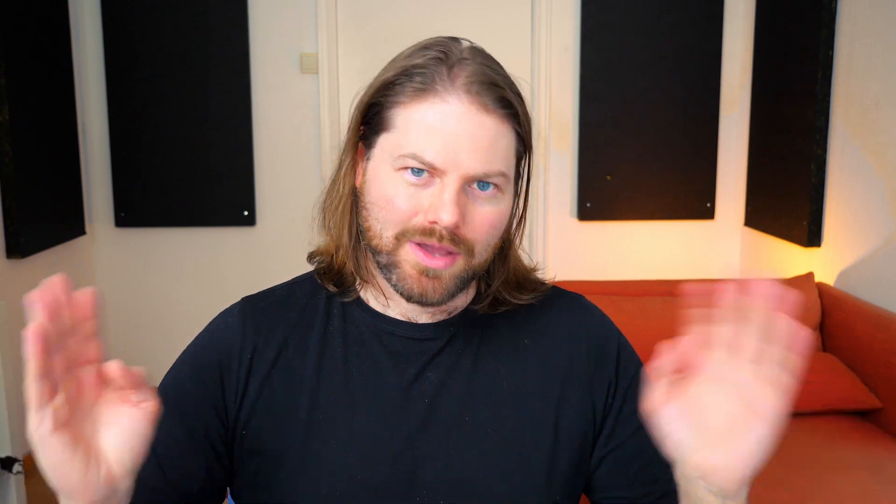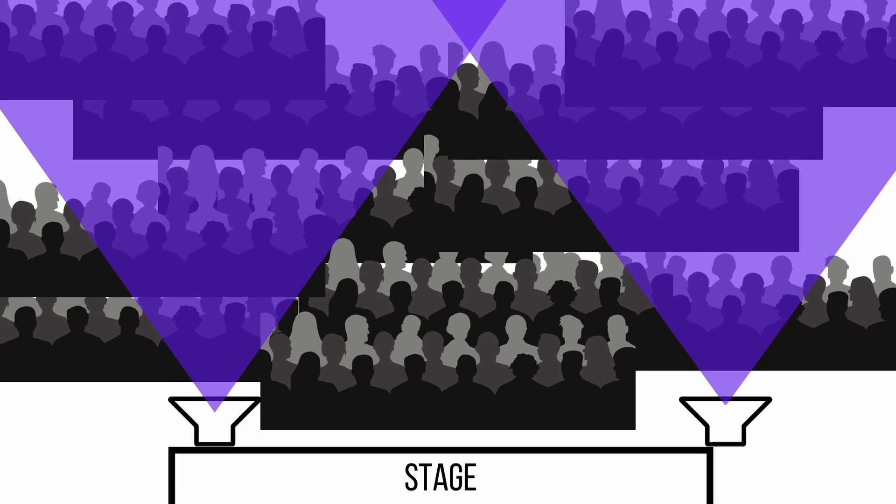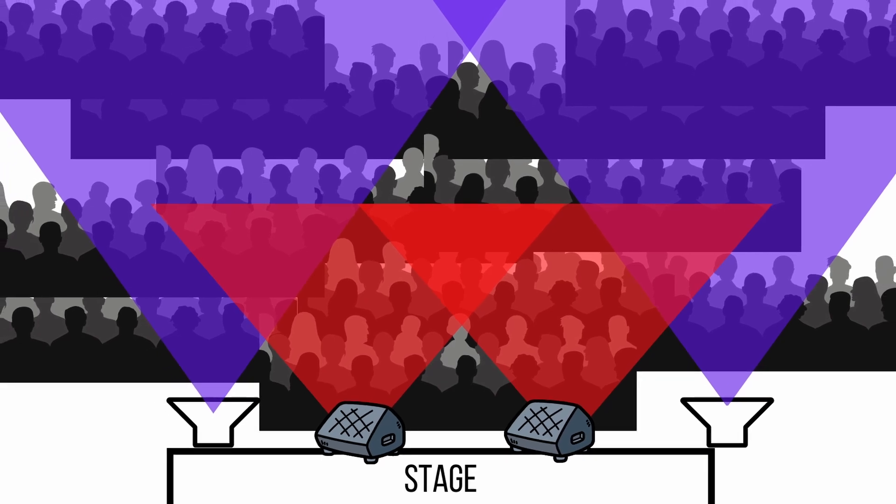If your stage is three or four meters wide and you have speakers at each side, you're quite likely to get good coverage of the whole audience if they're only five or ten meters back. As the stage gets wider, these two speakers are further from each other and that 90-degree angle doesn't overlap in the same way — it doesn't cover the same area. There ends up a hole in the center at the front of the stage. If people are standing there, they're not going to hear the vocals, and they're not going to hear the guitar as well — though in a small venue they're probably getting blasted by the guitar amplifier. But you have a coverage problem at the center.